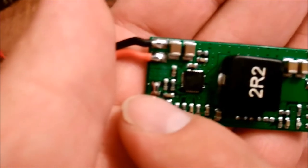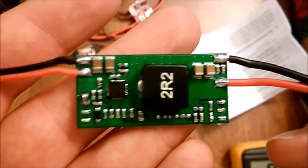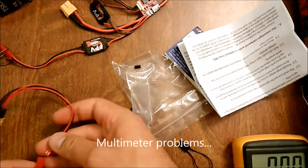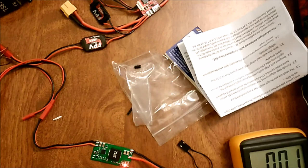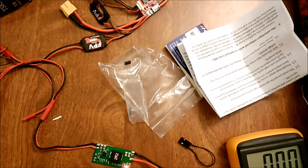All I've done here is remove the three little pins for the enable port and made a little solder blob on the 7.4 volt setting — just make sure you avoid the other resistors up there. Then I'll hook it into my 4S battery and we should see 7.4 volts. A little difficulty with my cheap meter but as you can see — 7.4 volts.